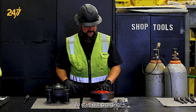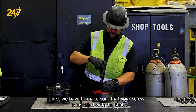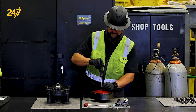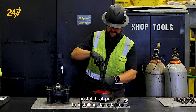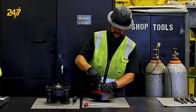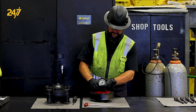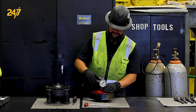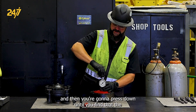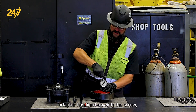To start out charging, first you have to make sure that your screw is installed with a seal — so you have your filling screw and a seal. We'll install that prior to installing the adapter. Snug it securely, install the adapter, make sure your T-handle is up, and then press down until you find that the adapter has lined up with the screw.